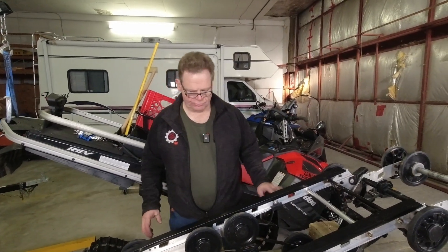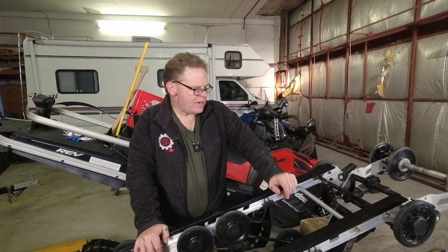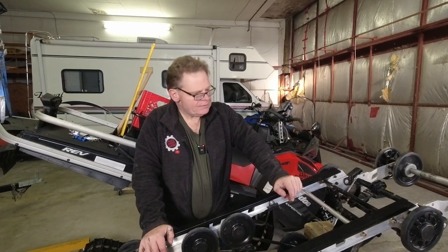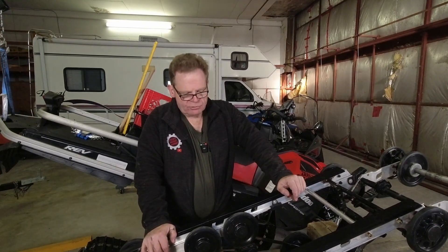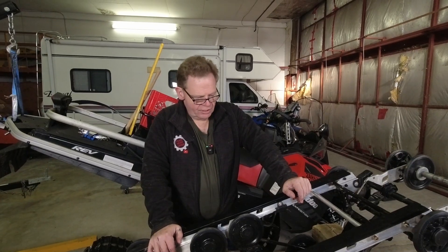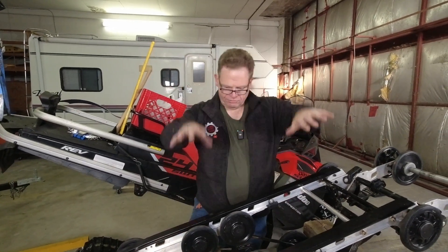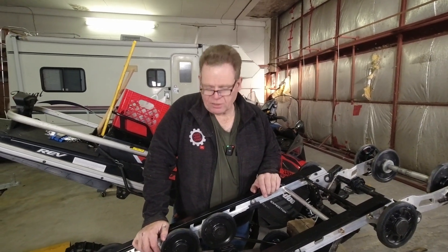Now it's time to wrestle this thing back in. There are a couple of approaches: one is to put it back in exactly the way we took it out with it jacked up in the air and kind of wedge things in, but I think that's going to be the more difficult way. If we lay it down on the floor and roll the machine over on its side, we can flip the track out to approximately 90 degrees from the bottom of the machine and wedge this in there. Using the roll-on-its-side method should give us a little bit of gravity helping out. Let me get restaged and I'll bring you back when we're ready.